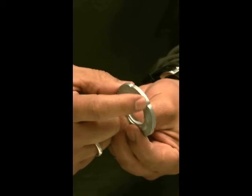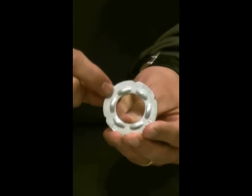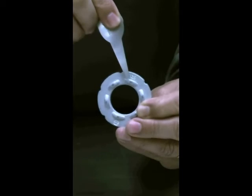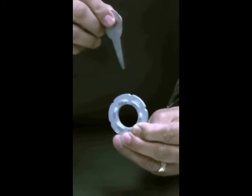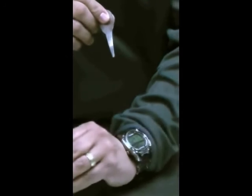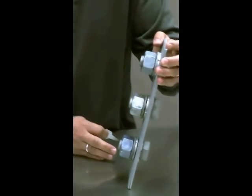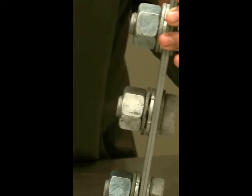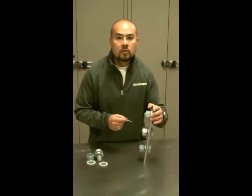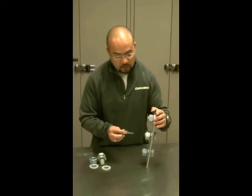The divots on the outside of the DTI are in the center of the protrusions. You would put in the feeler gauge directly over the divot, against the DTI, in between the protrusions. When you're out on a signal mast arm, you'll have to go up in one of the bucket trucks. The contractor, by specification, is supposed to provide that access for you. It does require fall protection training, so be aware of that.